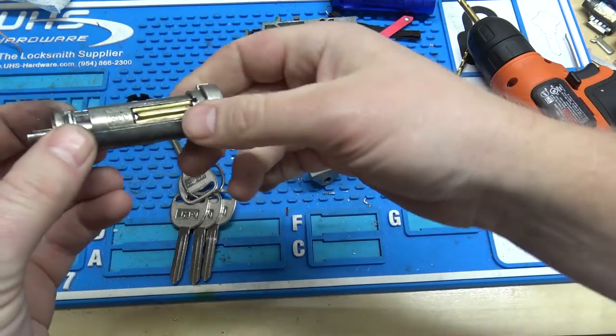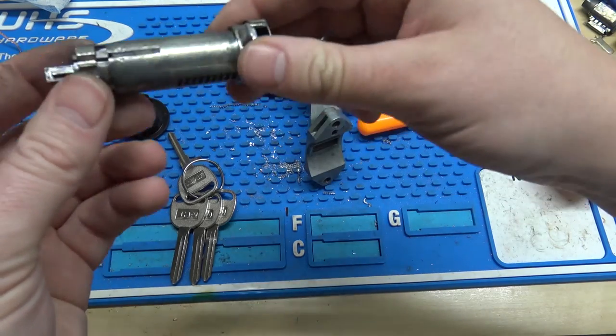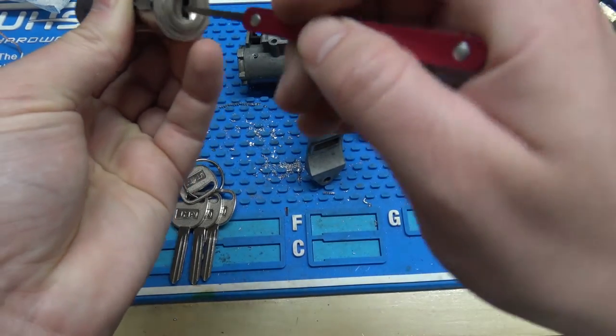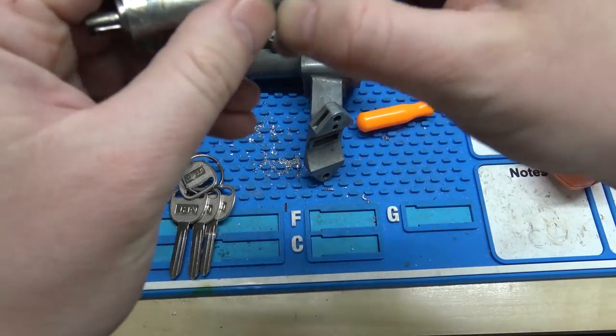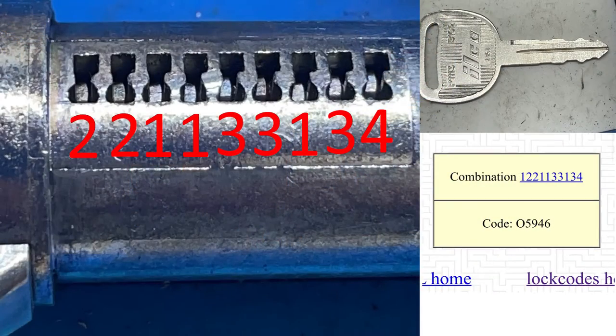So the way that you can make a key to it — I'm probably not going to be able to show on video — but you can pull it apart if you want to. I don't normally do that since I don't have any caps to replace, and I don't like trying to reuse them. These are just single-sided locks. Just put pressure on the sidebar and when you rake it with just a rake, you'll feel the sidebar drop. So right now the sidebar drops, so the thing is actually picked, and then when it's picked, you're able to look in this window and actually sight read it through these windows here. You can sight read it, and then you have your bitting. If you're not real good at it, you can use a code fill program to know if you've got a valid code or not, and you cut a key and it'll work.